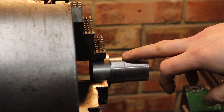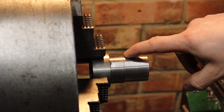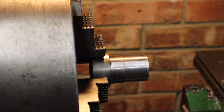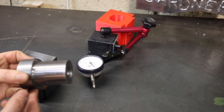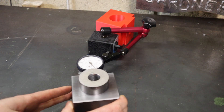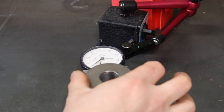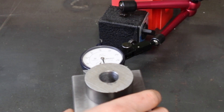I've probably overcooked that a little bit - I think I've got about 0.1 to 0.2mm too much on the depth of cut. But it's not going to affect the part at all, it just means there's a very slight lip here where in theory this high spot should have been completely flush. So I can take this now, head over to the bench and test it out on the tool post. I couldn't really be any happier with this part. The eccentric shaft has come out really well. Checking how much movement we currently have with the DTI gauge - as I turn the eccentric shaft there's probably just over 1mm of movement on there, so that's worked out really well.